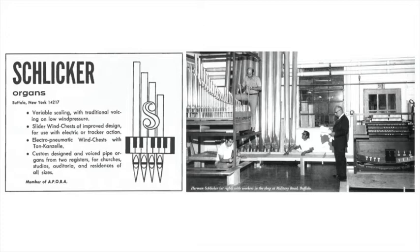The pipe spoke fairly well before, but it was soft. I made it a little bit louder, and then it got slow, so I have to make another adjustment here. And that you do by, first, you have to look at the pipe. This adjustment can be made in two places. Either the upper lip can be brought out, or the block can be brought down. It's just a matter of deciding what you like to do, or what should be done, I should say.